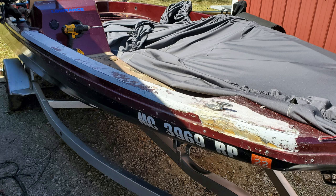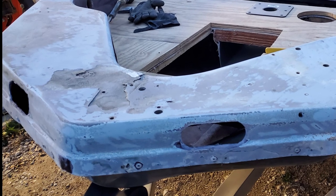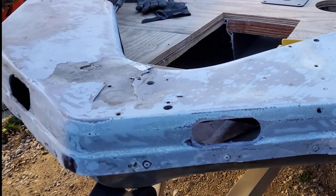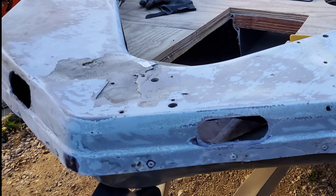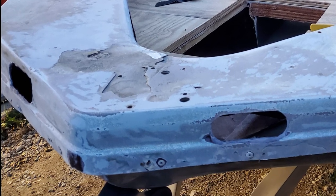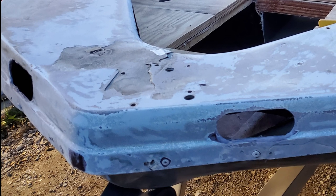Most of the topside paint flaked off surprisingly easy with a razor blade scraper and a DA with 80-grit sandpaper. I had to get this down to bare glass so I could make repairs to any areas that showed signs of cracking and provide a solid base for fairing compound. One area in particular on the starboard bow needed a lot of attention — at some point in its life it had hit a dock at ramming speed, and stupid amounts of fairing compound were used to cover it up.